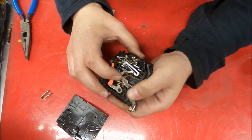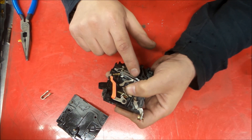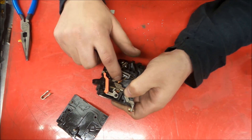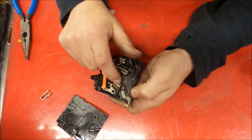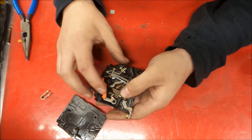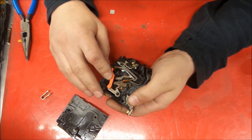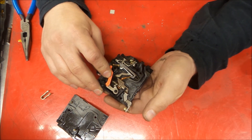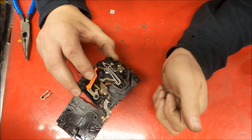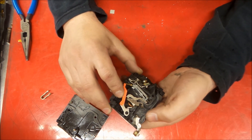After a lot of screwing around, I think I actually got this thing figured out. This is a bimetallic element that the current flows through via this bonding wire right here, connected to this contact that I now have touching between the piece that goes to the bus bar. So what happens is: if you turn the breaker off you open up the contacts; if you turn the breaker on, the spring tensions that and holds the contact together. Now this bimetallic element heats up and opens — just like that — and the breaker goes into the trip position.